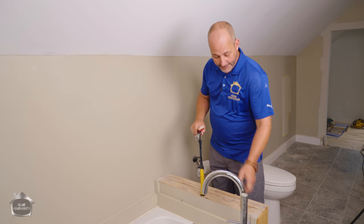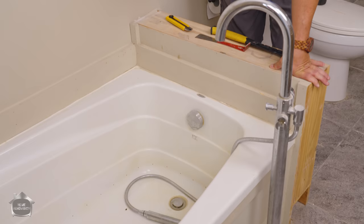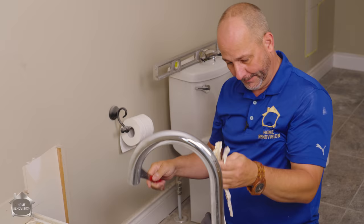We're going to open up the line — there's a little bit of water coming out, but generally I'm just allowing air in. I opened a faucet on the main floor so the lines are all being drained. That's what we want because we're getting this removed off the floor too. While it's draining, we're just going to peel this open — looks like just brad nails, no adhesives. That's great news. The problem with most shower and tub systems in the world today is 95% of them require silicone to be the waterproofing, and it never, never holds. You're going to have a temporary shower if you buy something that needs silicone to keep it from getting wet.